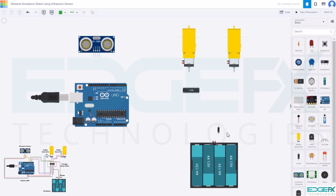Connect the positive of the battery to the anode of the diode. For this positive line, select the wire color red. Connect the cathode of the diode to the 9th enable 3 and 4 pin of the motor driver. Connect the 8th power pin of the motor driver to the 9th enable 3 and 4 pin, then to the 16th power 1 pin, then to the 1st enable 1 and 2 pin, and finally to the 5V pin of the Arduino UNO.